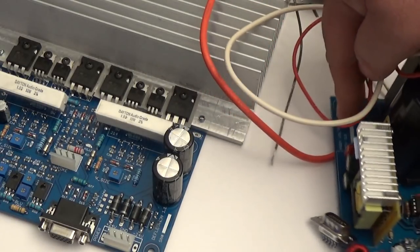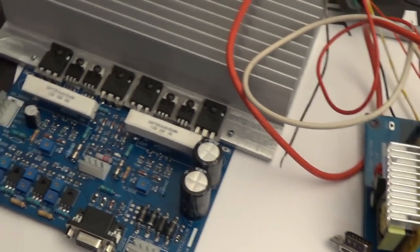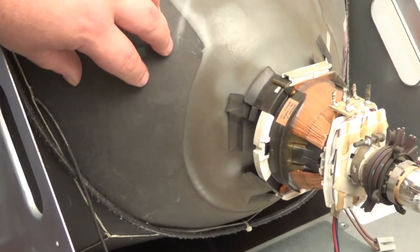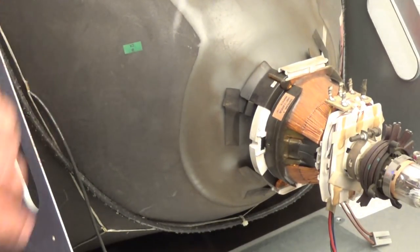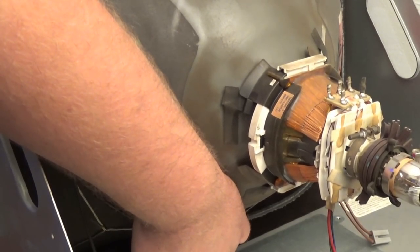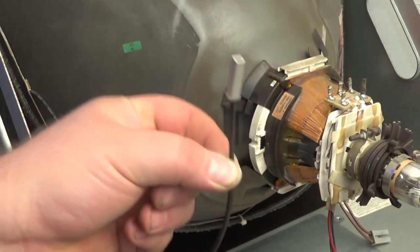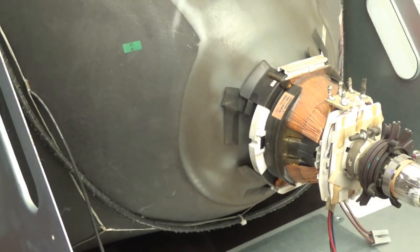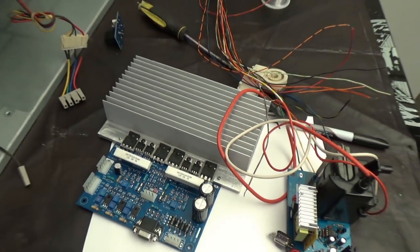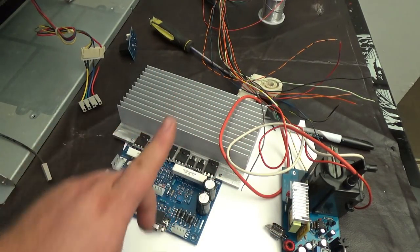What's the DAG strap on the monitor? On the back of a CRT tube there is electrically conductive paint — that's your Aqua DAG. There is a strap that goes across the DAG. Most tubes — all tubes will have it. There's a bare metal wire and it's usually connected to a wire. That needs to be grounded with these other boards as well. All grounds need to be shared on the monitor: this needs to be grounded with this, and these two need to be grounded to your tube.